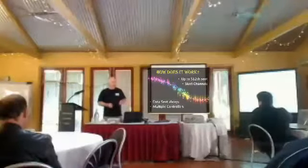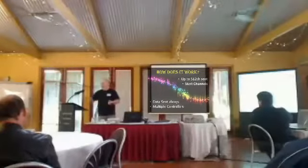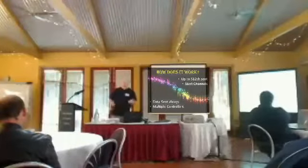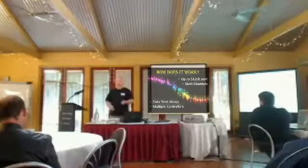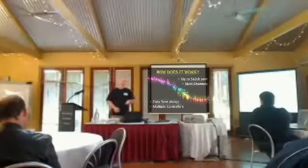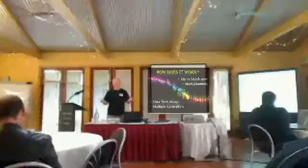Where that becomes a factor is if you're going out to the road and getting little 3-channel controllers to run RGB strip in DMX. 3 into 512 channels is about 170 channels, and that would be 170 controllers. That's going to be the same specification for the number of things you can have on the piece of copper. Makes sense.